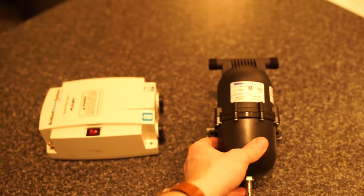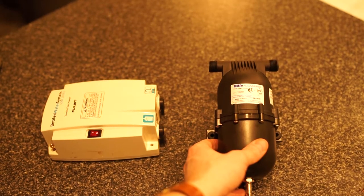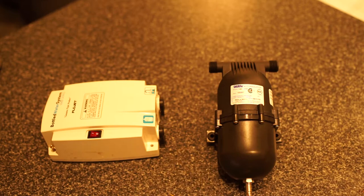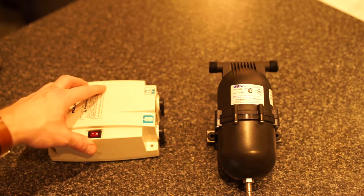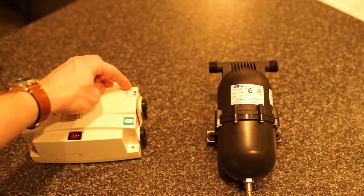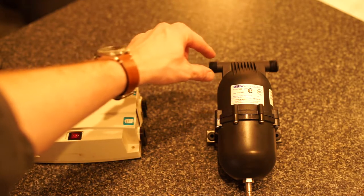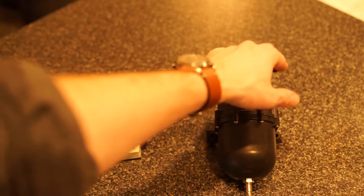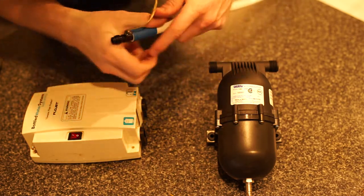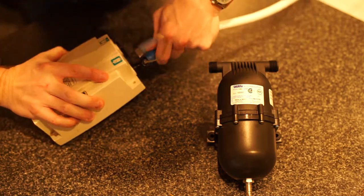So I'm going to hook this flow jet pump into this thing called an accumulator tank, which is going to buffer pressure. If you just take the output from the flow jet in isolation and you try to feed it directly into the machine, it turns out it doesn't work. At least it didn't work for me, because the line doesn't quite have enough place to build pressure in, so the machine always gets stuck. So instead, I'm going to take this output from the flow jet and pump that into this accumulator tank. Then I'm going to use that tank to feed the machine.